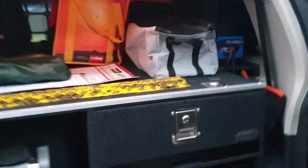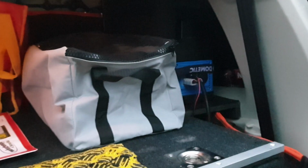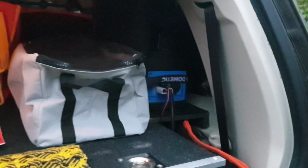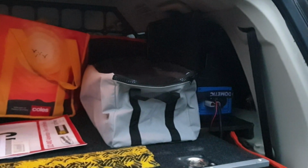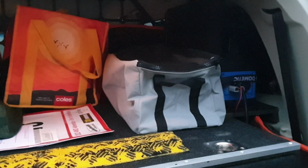So just on the laptop, you might recall I tested the inverter, little 150 watt inverter plugged into the companion. It worked, so I cut the SIG plug off, got a double adapter for the Anderson. Unfortunately, as soon as I plugged it in, it's like the Anderson detected too much load, so I think I've reached the limit of the companion. I'm now going to have to get another little inverter this morning with the SIG plug back on, and I'll have to use that separate, you know, I'll have to sort that out. So anyways, all good. Let me show you up on the roof.